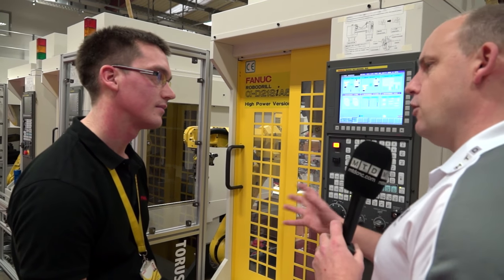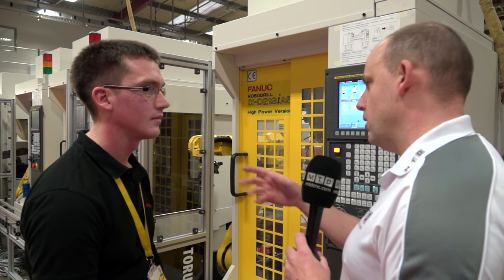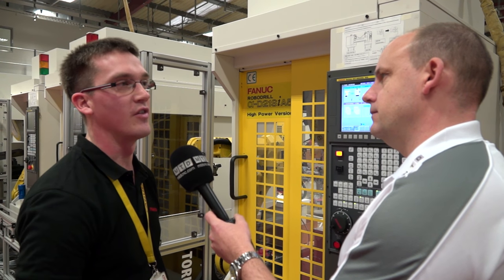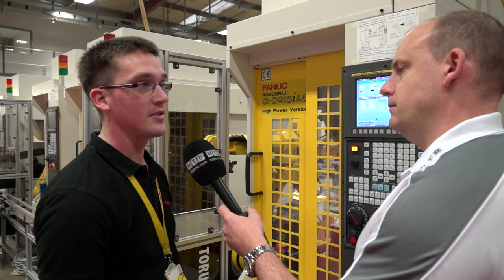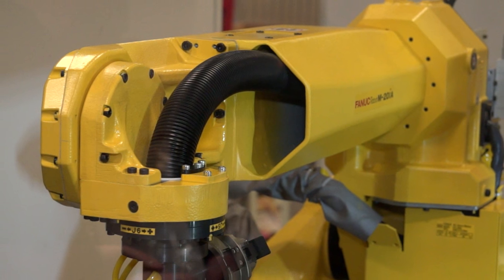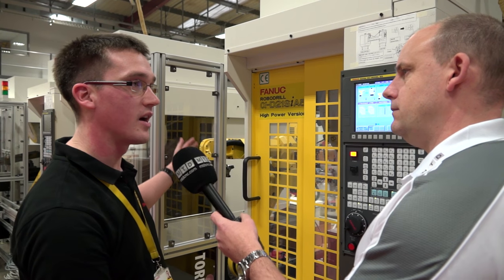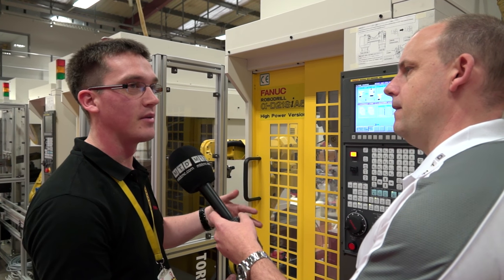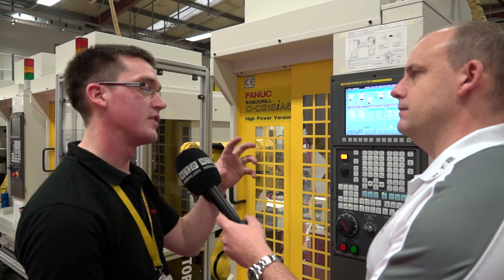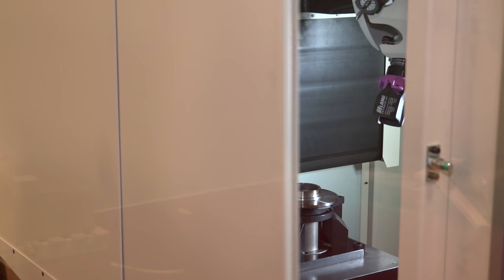I've got a machine shop with a lot of guys working around — what about health and safety? I don't want that robot coming through the window and causing an accident. Yes, that's a lot of people's concern. In the first instance, the robot will only go where it's programmed. But on top of that we have an extra layer of safety with our DCS, Dual Check Safety Position Check, where we can create a 3D box and tell the robot it cannot go outside that box. If it attempts to go out — say towards this guarding window — it would cause a category 1 e-stop, so the robot stops before it hits anything. We can also create a switchable zone based on a signal, so if the side door isn't open but the robot's travelling toward it, it again stops on a category 1 e-stop and won't enter the machine or cause damage.